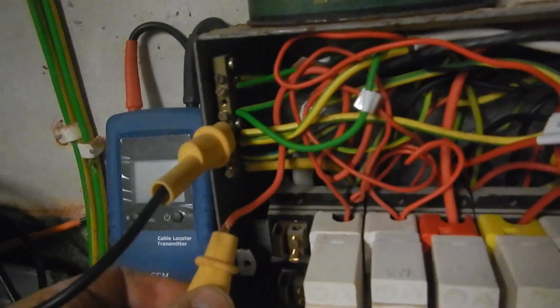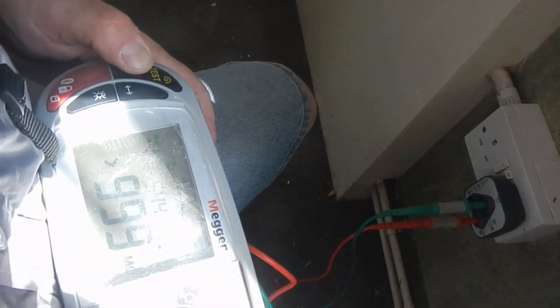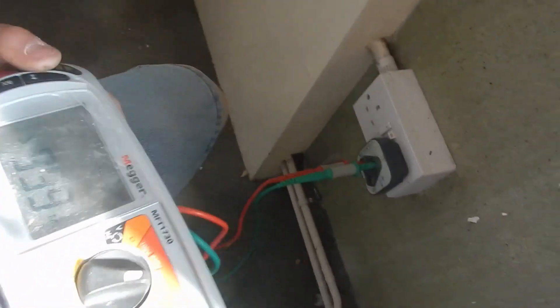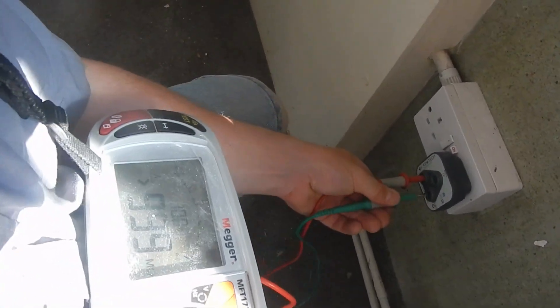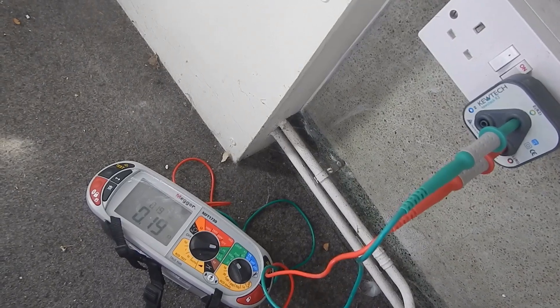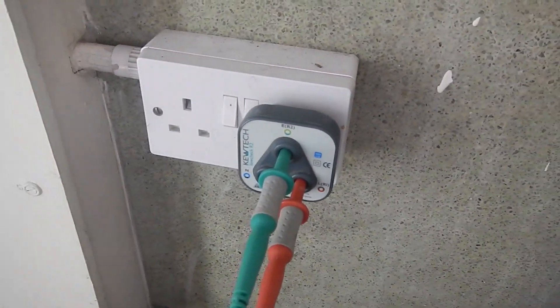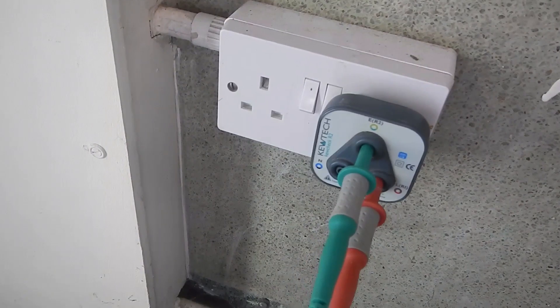There she is. I'll go upstairs. I'm going to be on this circuit. Reading: 0.24, and that's not zeroed, so that's 0.14. Earth-in-line at 500 volts: 999. Earth-in-neutral: 999. Two live conductors: 999. 0.19 - so if that's 0.19 and 0.14, I do need to find the ZE. I don't know if I found the ZE at that board.